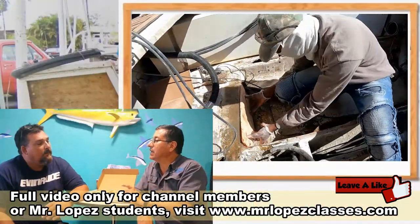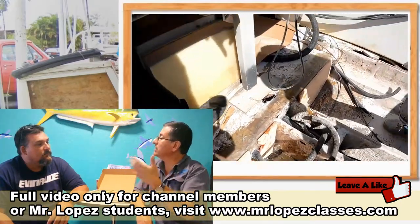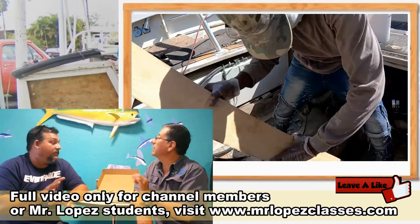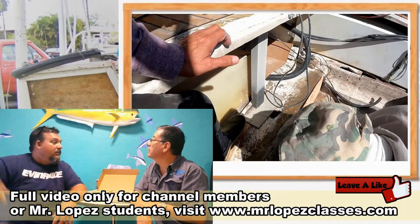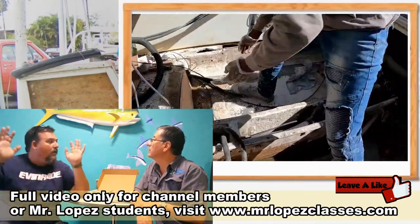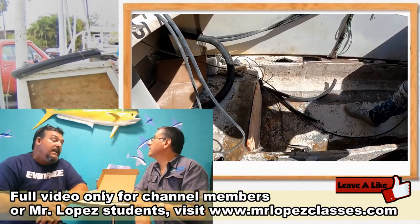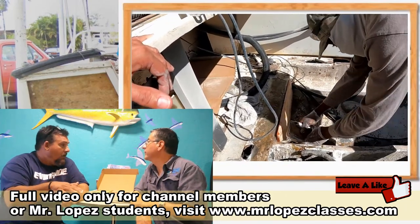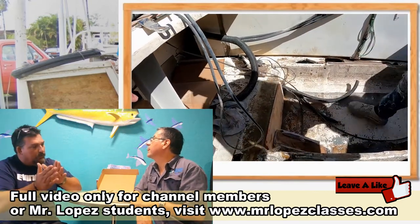Another important thing, Danny: I applied the first layer — can I apply another one the next day? Absolutely, no problem. It's better to always do it in layers. When we used to build boats, you spray the gel coat in the mold and you have to wait. The next day you come, and depending on how it feels, you lay the first layer of mat and walk away until that dries, then build it up like that. You're not throwing layers and layers at once. Once you have a base — like the gel coat, the mat, and one layer woven — then you can do two or three mats at a time. But that first initial layer, you have to do it in a process.